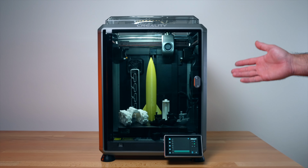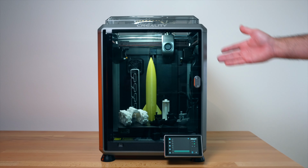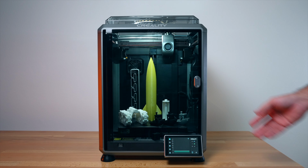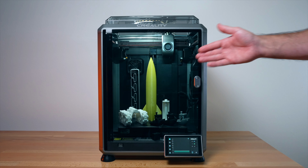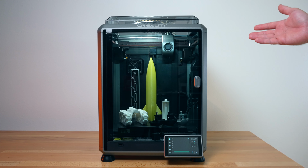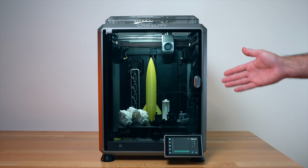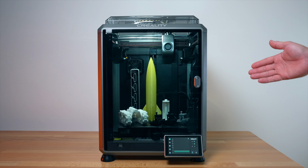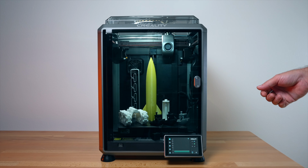Again, printing 300C with any kind of abrasive filaments is a breeze. A new dual extruder pushes beautifully. We got a large external parts cooling fan on the side, which helps with overhangs that we saw in the ABS print. Also having some carbon filtering in the back there on that fan is nice. The smooth PEI sheet is good. Everything seems to stick. I am a little worried about that little clean out part in the back where the nozzle goes back and forth on the ribs, as it is just a stick on to the plate.